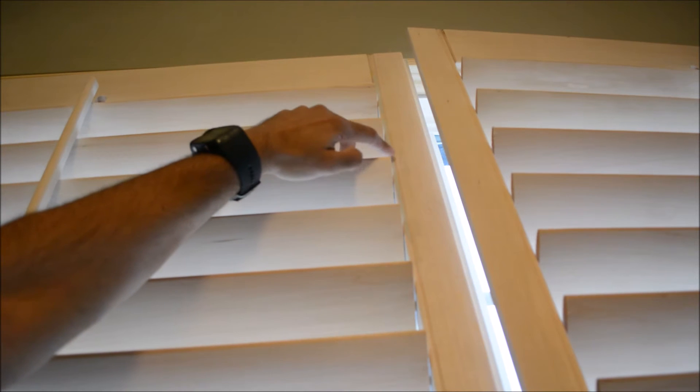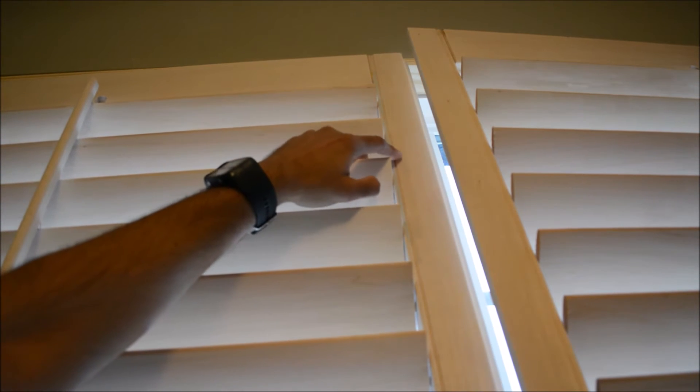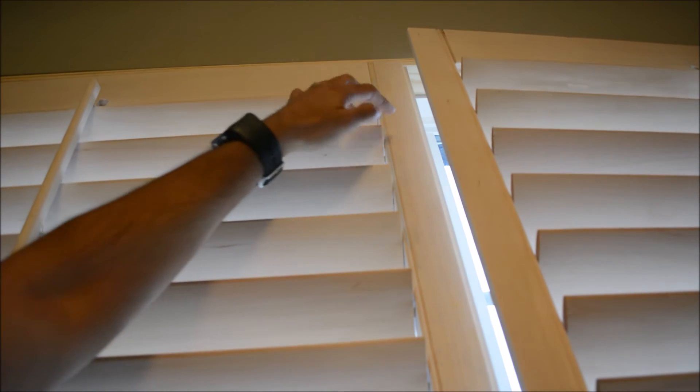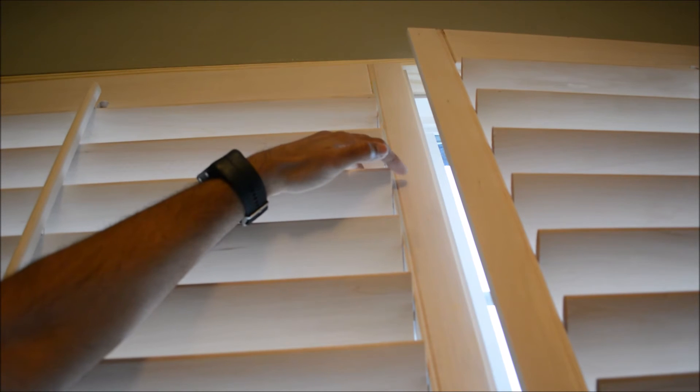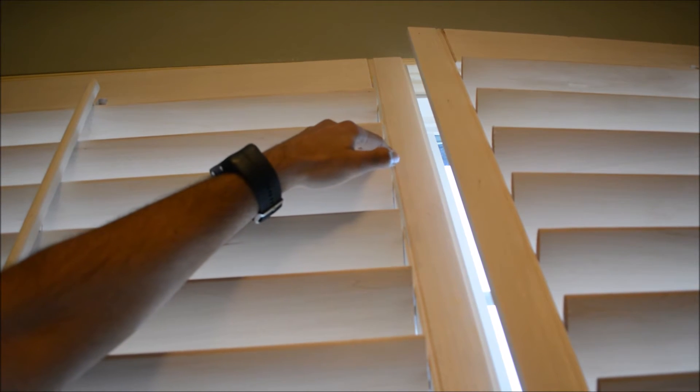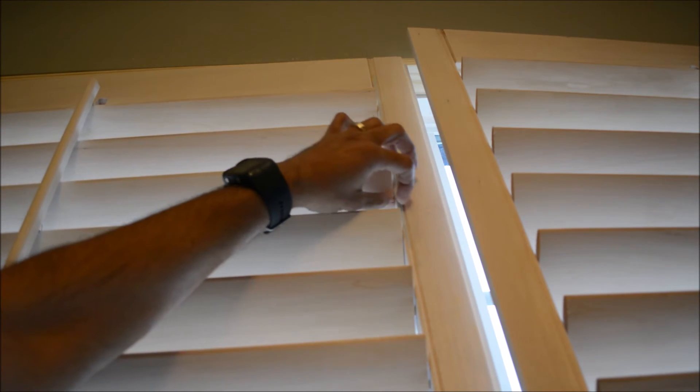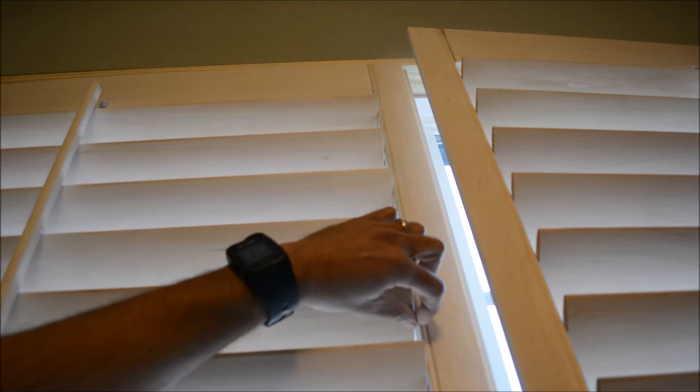You need to make these beads on the stile. Please make sure you use a fence to run it through the router with the bead router bit. I did not use a fence — I was trying to just glide it along the ball bearing, and I screwed up this part. It was totally botched and I had to use a Bondo mix to fix it. I have a video at the end that captures how I did that. Make sure you use a fence for making this bead.